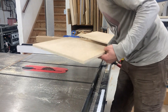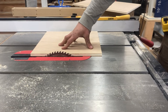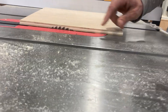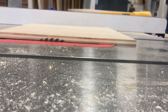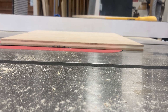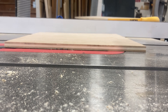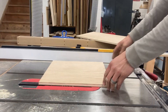You're going to go through one of the three layers. So the first thing you do is pick a tooth that's at the top and set it so it's going through just one of those three cross bands. That looks pretty close. You can always raise the blade, so if anything set it low and raise it after. Set the blade to height, then set the fence.